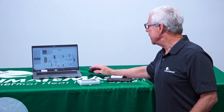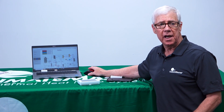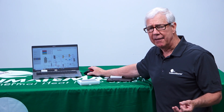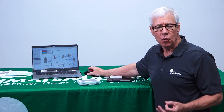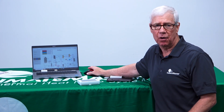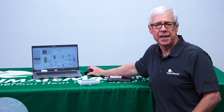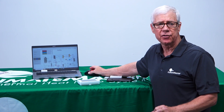On the far right of the diagram, you see a compressor with refrigerant traveling out and through a reversing valve. You will see the pressures and temperatures of the refrigerant as it travels through the reversing valve in cooling mode, or in heating mode — which would be a very unique day in Miami. We then go through an air coil, and those air coil temperatures and pressures are key because we want to know the temperature drop between the air going into the coil and the air coming out. Generally, most heat pumps target about a 20-degree temperature difference between entering and distributed air. In real time, you will see temperatures and pressures as the system operates.